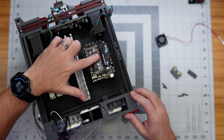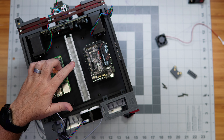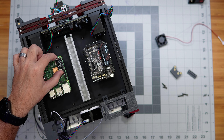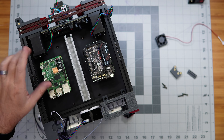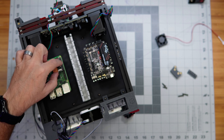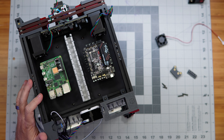The guide also mentions specific jumper placements for each board. These two red jumpers on the control board were requested because we're using sensorless homing — that lets it know there are no physical end stops to trigger. Over here on the Pi, there's a little hat for the accelerometer to run a ribbon cable up for input shaping, which we'll do eventually — but that cable is only there when we need to run input shaping. It just fits onto the GPIO pins of the Raspberry Pi.